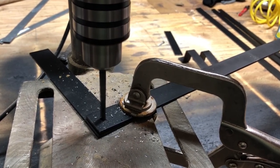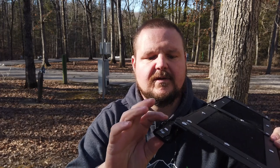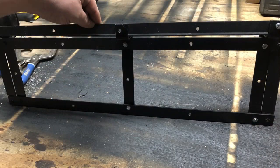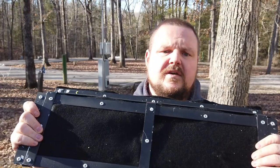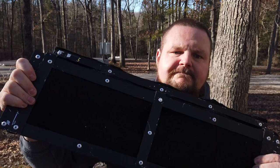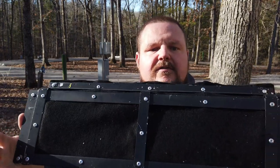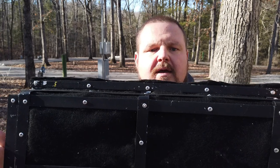To give the frame stability and allow me to pre-drill everything - since you don't want to drill while the fabric is on there - I took some small bolts and put them in where each rivet would go, just hand-tightened. That gave it enough stability. The frame can shift a little side to side, but adding a center piece helped a lot. After I put the blanket on, it's pretty strong - before the blanket, pushing the corners would cause it to twist, but it doesn't anymore.